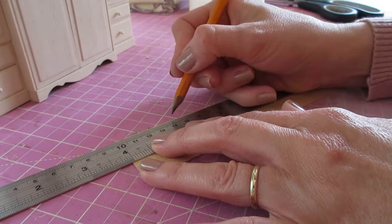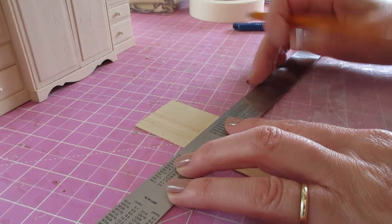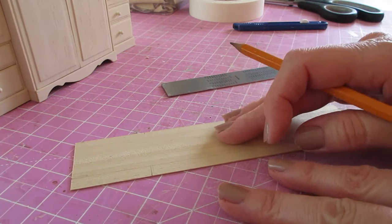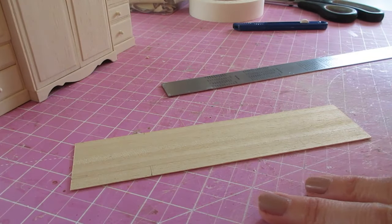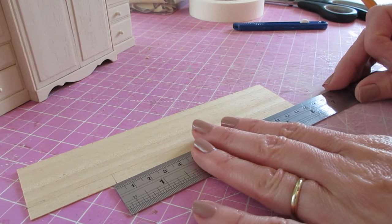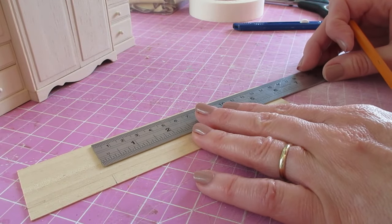Join that up going up to that first line. What we're actually doing is copying the top of the wardrobe onto this piece allowing for an extra millimeter in front of the sections to be cut out. Do that same thing at the other side — measure from the edge of the wood up to your pencil line, take off a millimeter, and do that at the other side of the wood as well.